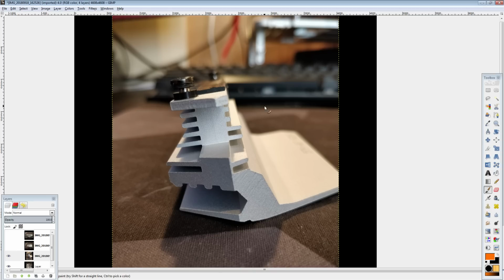This is a real heatsink, and I hope that MSI going forward just keeps recycling this heatsink as much as possible, because this has a lot of surface area. It's reasonably heavy. The only concern is getting the hole spacing, but for any generic 4-phase, even weaker 8-phase or 6-phase VRM, you could fit a lot of different VRM implementations under this heatsink. So I hope MSI just keeps using this, because this is a really, really nice heatsink. It has a lot of surface area. It should do a great job of cooling the board.